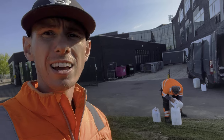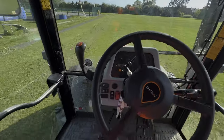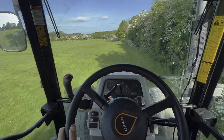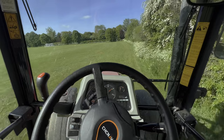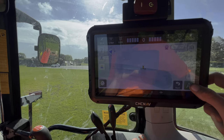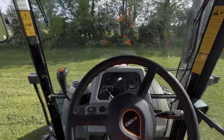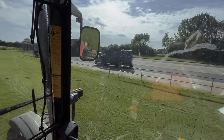At the next site it's time to fire up the CHC navigation system, unlock the Trimax, get it dropped and get cracking. Starting with the smallest area of this complex - the auto steer is walking faultlessly this time and the stripes are looking impeccable with nice straight beautiful lines. I move on to the next large area, starting with the boundary. Same sketch as the site before: I set a couple of lanes in for turning space. Once I've completed the line I move around the site doing the side boundary, then the opposite end. I then need to set my A-B line - I click A and start driving forward, attacking the center of the pitch through the goal mouths, the penalty spot, and the center circle all the way to the end, click B and save that line.